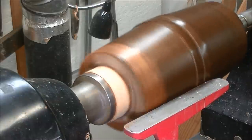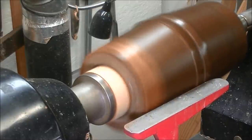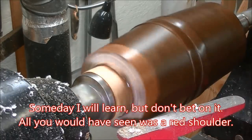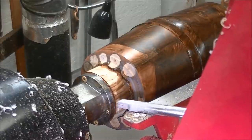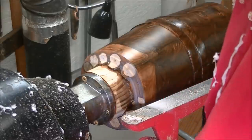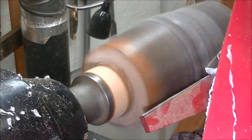That's just too much bounce there. It looks like at about 1500 RPM it starts to do its thing, so I'll keep it there until I get her down. I may get some chipping until I get her round. I've got gremlins in here — somebody forgot to tighten the tool rest down. That's why it kept getting lower and lower. I like to be just a hair above center — it's tight this time.